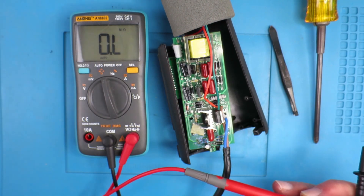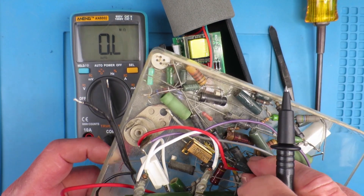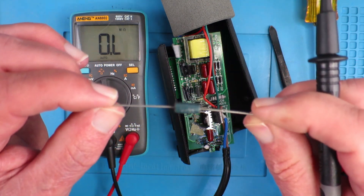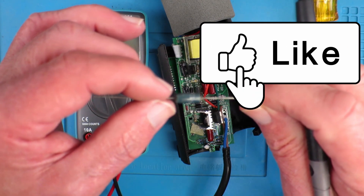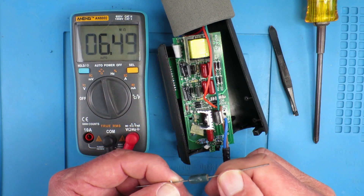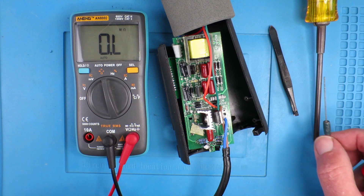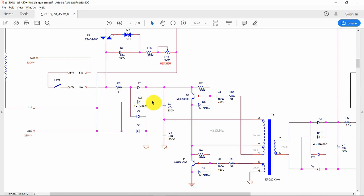What I've done is dig around — we have a box where I take components from faulty units and stash them away against a rainy day. This resistor I found probably has more years than I do. 1 ohm is indicated and it's a nice chunky ceramic resistor, so that should do the job. Measuring it on our meter: 1.2 ohms, so we're in the right ballpark and it's the right physical size. Let's get that swapped out and see if we've affected a repair. Unfortunately, just replacing this resistor didn't effect a fix.